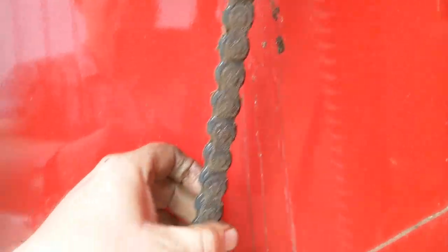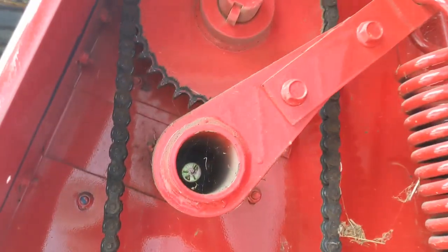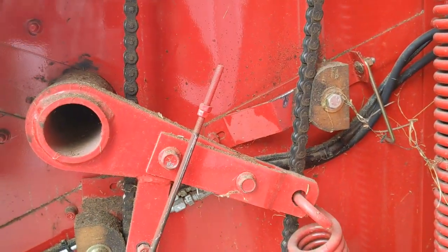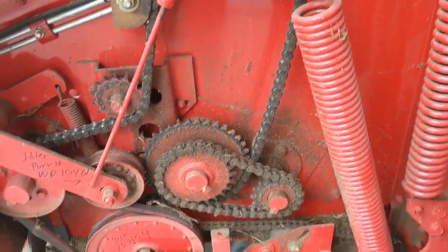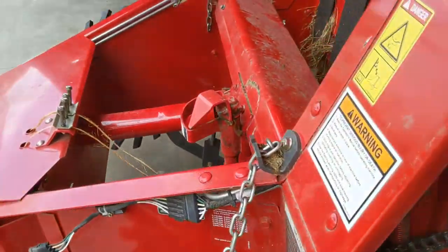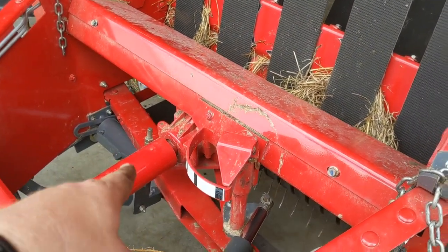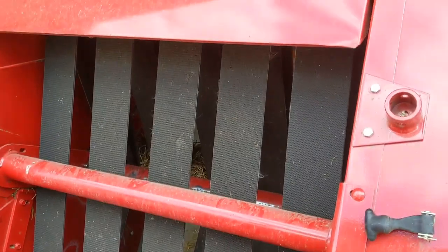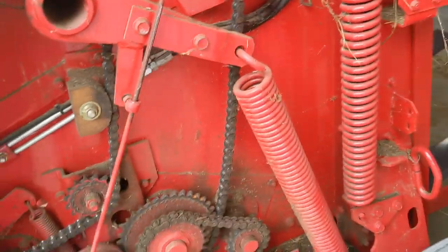This is not good — you need this deflection cleaned up and adjusted or else you're going to get surging. You'll hear it and it will also be rough on your gearbox. If you run your shafts too loose, you could probably even twist off your shaft down there. These are little things you've got to do to the 1734 to get it broke in.